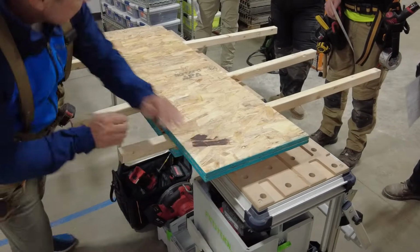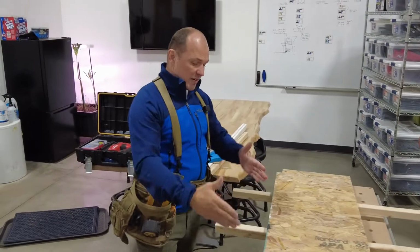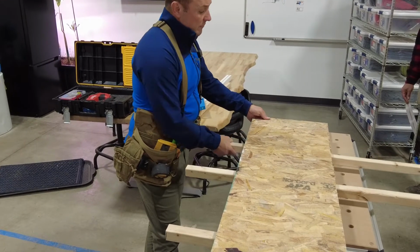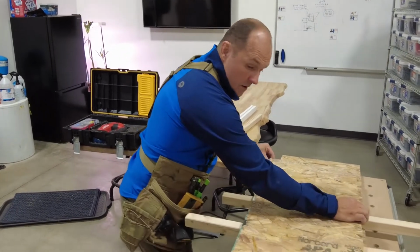So you see what I just did? I put one on each side of the cut. Well, what's going to happen when I cut down it? It's going to go teepee, right? Right in the center. So you need at least 2 on your keep side, and then this side I don't care if it falls. If I want it to fall, I want it to fall up instead of in because I don't want to pinch my blade, okay? So keeping it close, stability, all of that.